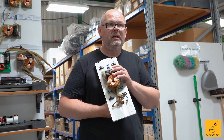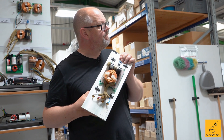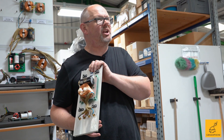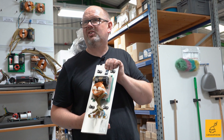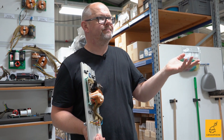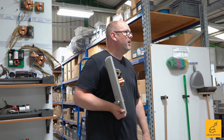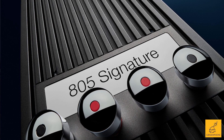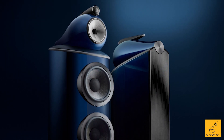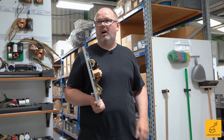We don't need to use very many elements to change how those drive units behave and bring them into the appropriate alignment. The reason that counts is this is an electrical circuit, and there is no electrical circuit in the world that was ever improved by having more stuff in it. So the shorter and simpler this is, the more likely the music gets from here to where we want it to go. We deliberately choose simple. This is a first-order crossover with four components in it from an 805. Even when you get up to the big guy like an 801, it's first order on the high frequency, second in and out in the mid, third on the LF — very straightforward and very few parts.